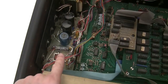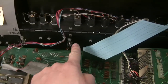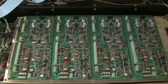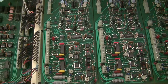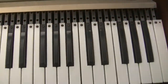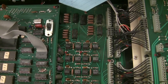The power supply is on the left, and like the other OB series there are little connectors that lead to off-board voltage regulators or pass transistors mounted on heat sinks on the back of the case. This is an 8-voice so it has two motherboards, each with four voice cards. It uses more discrete circuitry than the other OB series, though there are still a couple of Curtis chips for the envelopes.